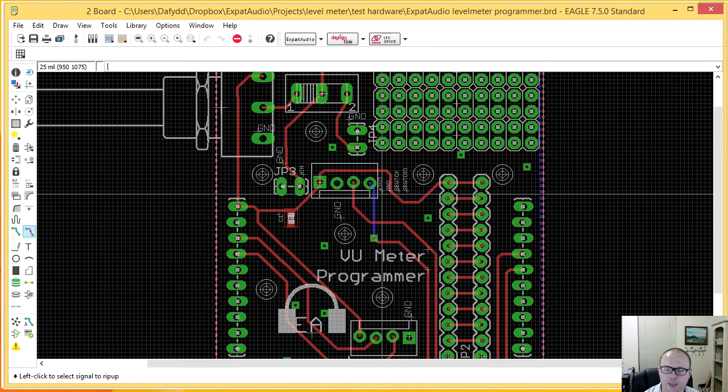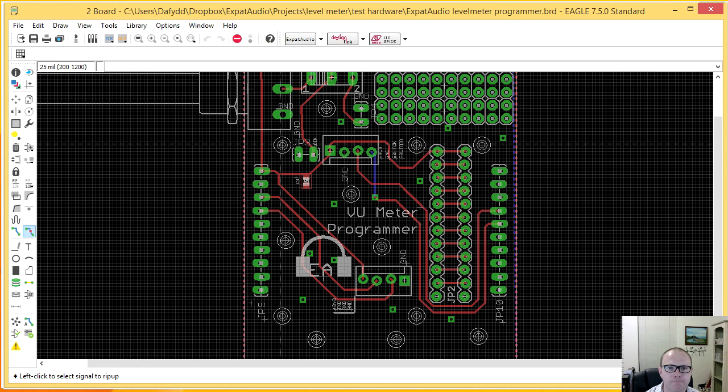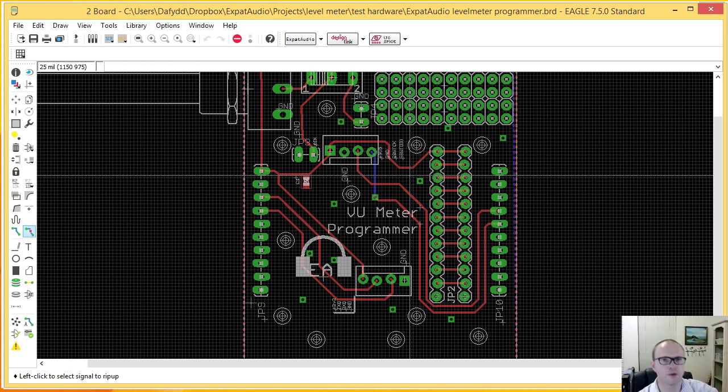And okay, if I can stop clicking as well, sorry about that, folks. The area you see here, these are pinholes for the board itself. These are used to align the board with these pogo pins. So these pogo pins ideally go into a hole on the board, and so you have to pre-align the board before you start pushing down. Otherwise, your test pin will be off from where you're testing on the board, and so on.